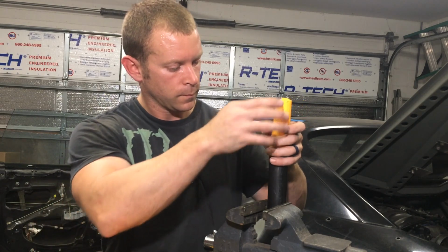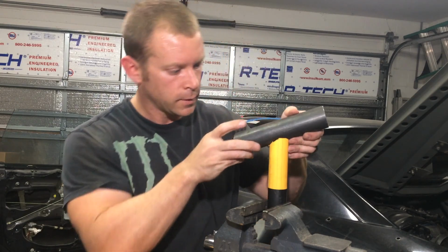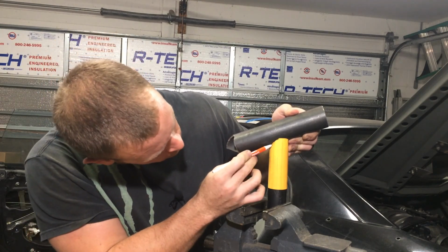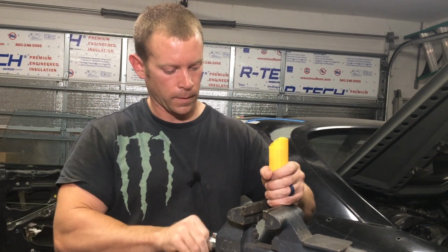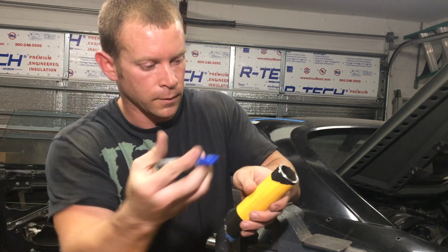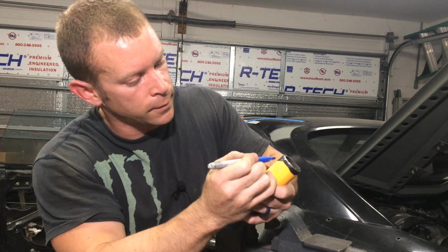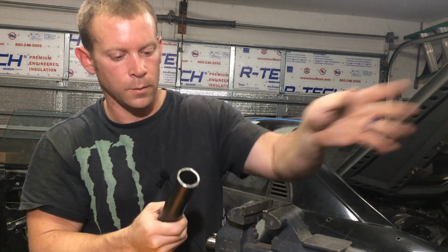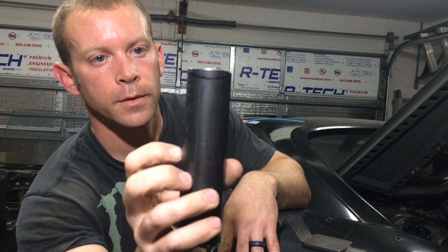Now that you've done that, slide it right back onto where you got it from. And there you'll see that matches your pipe almost perfectly. Still a little bit of a kink in there, and you just come back, trim it again, mark some lines. However, once all that's said and done, roll it over your tube and you can see the exact line you're going to have to cut. So Sharpie, transfer your line over. That's done with. So there you have it. That's going to be your perfect notch contour, and it'll fit whatever angle you're working with.